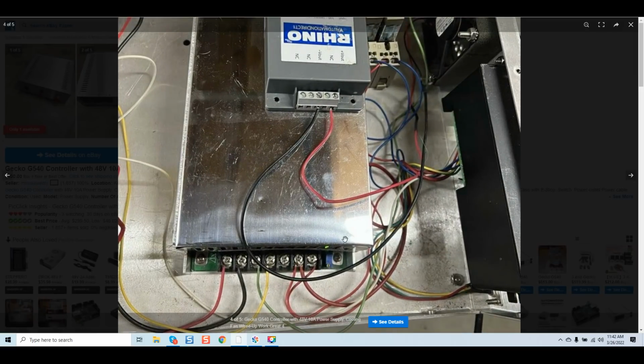And as we come in here, once again, we can see the rat's nest of wiring. Over here we can see that we have two leads going into one terminal. Now, on the first portion of the video I posted, I discussed with you why it came out with the dual 10-point output terminals for V negative and V positive, and this is why.